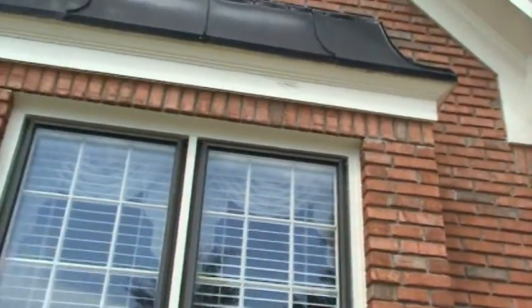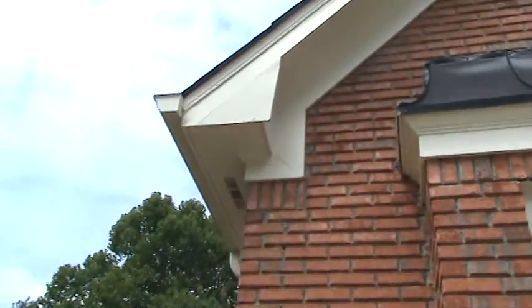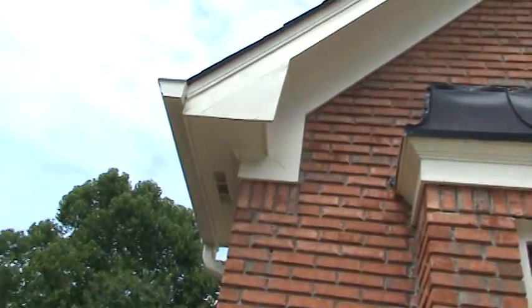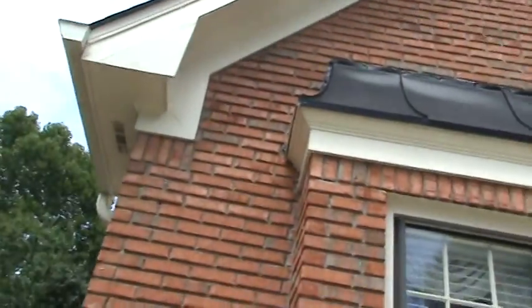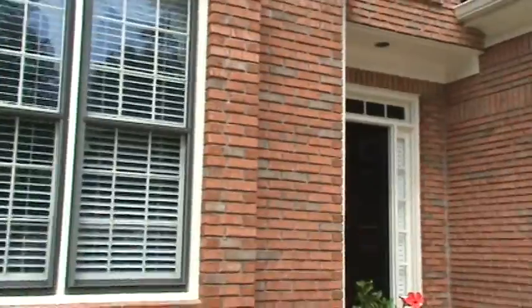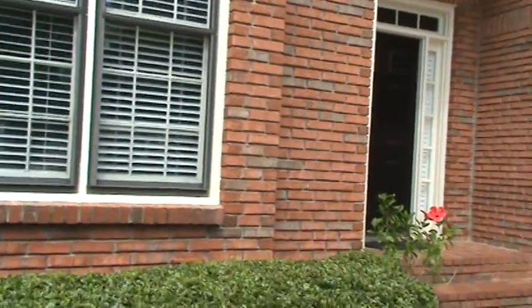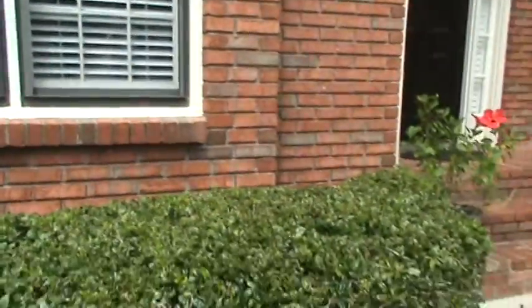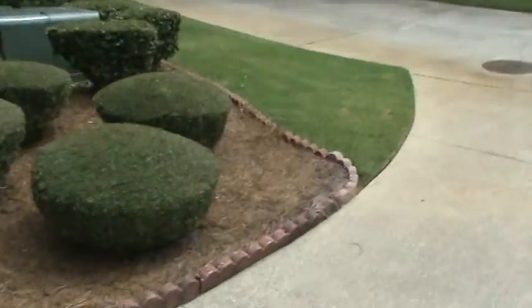We'll replace the rotted crown and seal it up. This dog ear on the left front corner of that bump-out is rotted, and you can see where the last person put some putty in there. Don't ever use putty — it's a quick fix. This nose right here is just starting to rot, and you can see it's finger-jointed. Now this trim was hand-painted — you can see the brushstrokes — but the siding was not. They sprayed it. I think they picked up brushes when the homeowner was watching, then went back to spraying when they left.